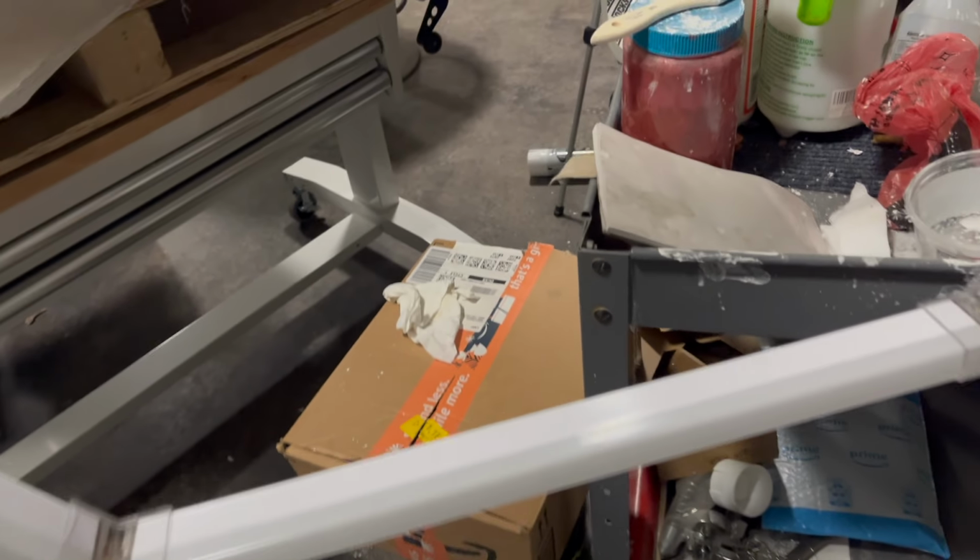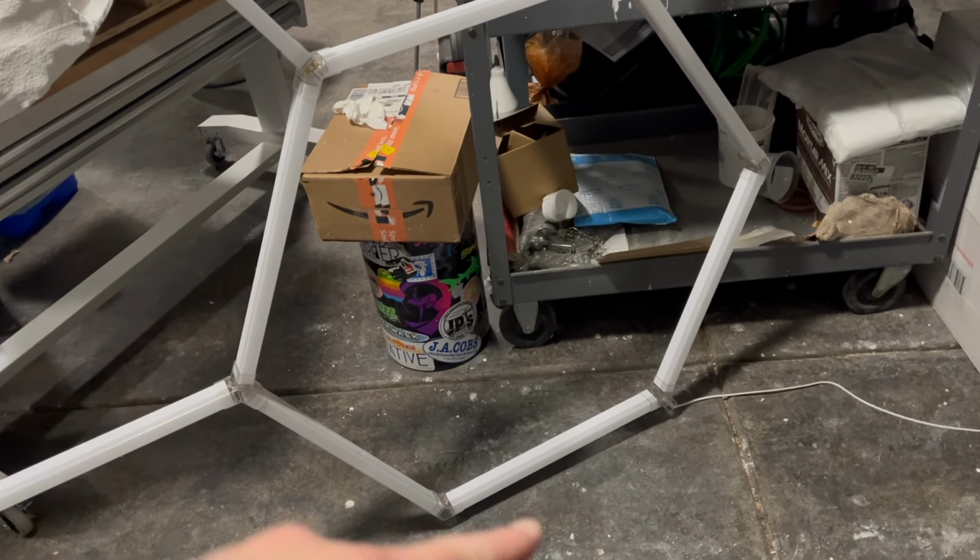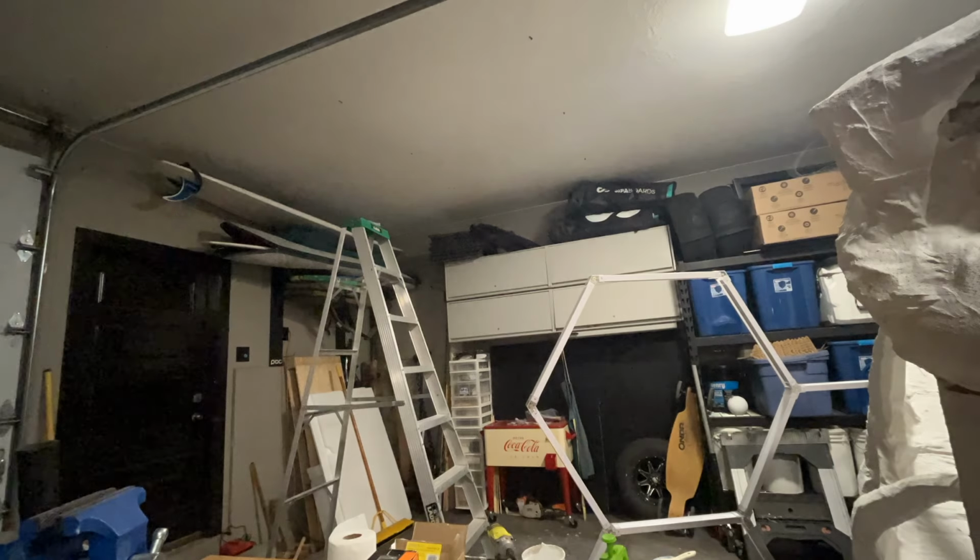Okay, I'm going to quickly explain how I did my measurements, what made sense to me. Maybe it'll help you with your install. I measured from outer edge to outer edge. It's 33.5 on mine, and of course 33.5 the other way too. From the starting point, I made sure this one and this one were spaced apart to hit the outer edges, and also the same distance from the wall, so it'd be square. I think I might be able to maneuver it around a little to screw in other supports, but I think with these 6, it should hold up there.